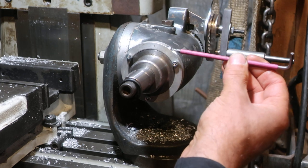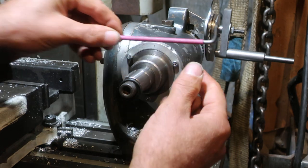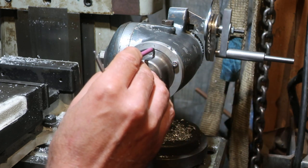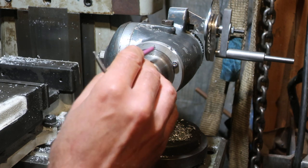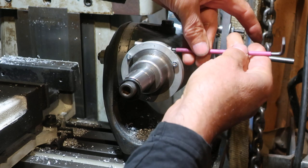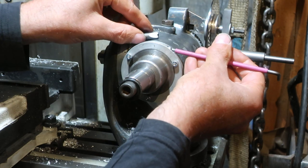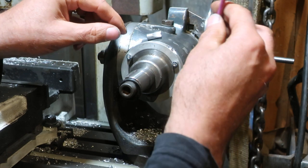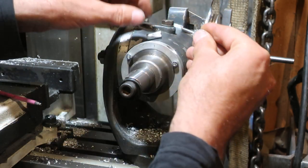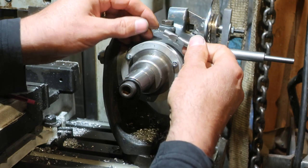Now, through here there is a bore. That bore is positioned such that a 4mm bolt, because that's what's used here, is tangent to the small internal diameter here. And that 4mm bolt bolts into this cotter here and runs through a clearance hole in this cotter here. So what we have is a pair of cotters that are 8mm in diameter.